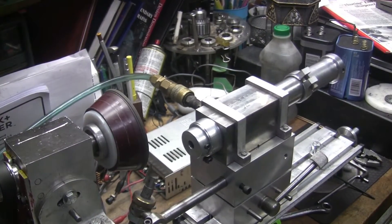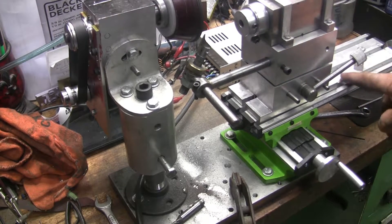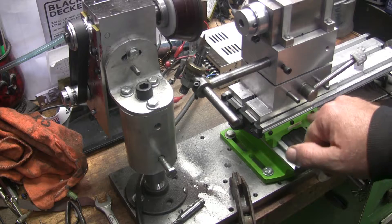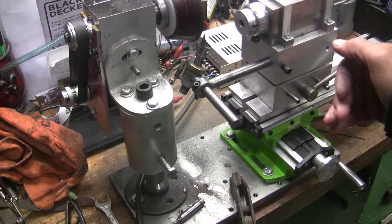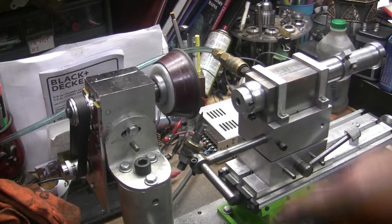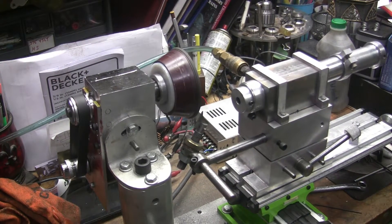This is actually the first time I'm kind of using my setup that I made. It's just a cheapy little cross slide that I bought, China-made. I had to cut the top plate or the table flat. I re-snugged all of the screws so there's no slop, because basically all I'm using is my Y axis right now. It's the same setup I had — a cup wheel on there, and it's just a cheapy 12-volt motor that I bought, and I have a 12-volt power unit back there.